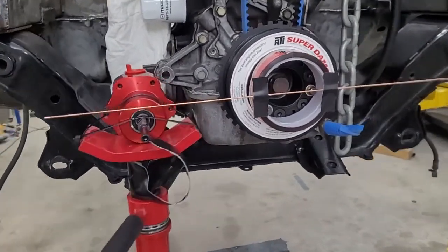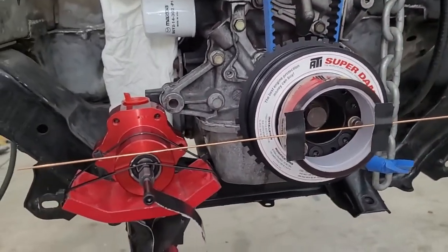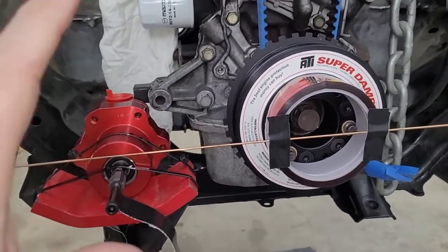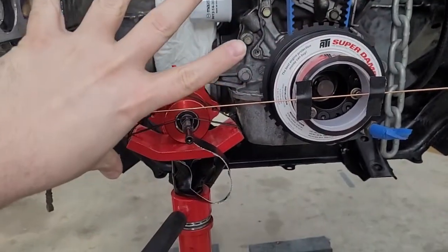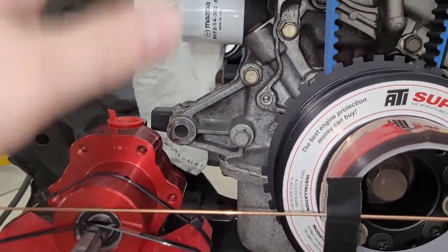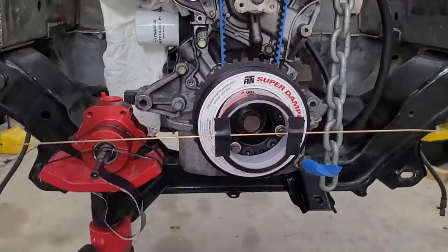When you bolt the pump up, it would be nice if the pump can pivot in a way that tensions the belt. You can buy these belts in different lengths and probably make it work without that, but we could design it so one bolt is a pivot and the other two swing — so if this was the pivot, the pump would swing away from the motor and tension the belt. Even though that small bolt isn't ideal for a pivot, you could potentially use the big bolt, though it would mostly swing down and not tension very well. We'll figure it out — no big deal.